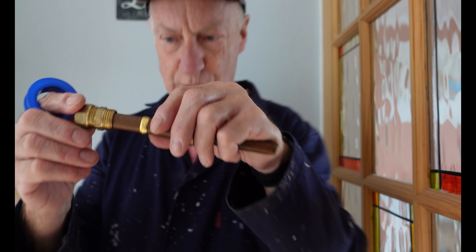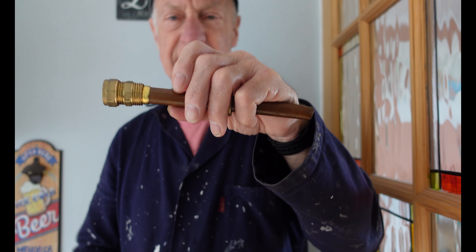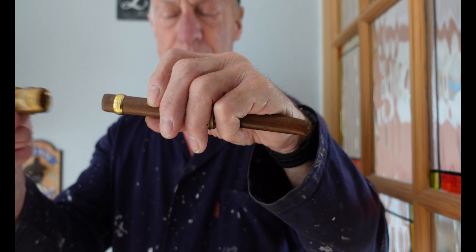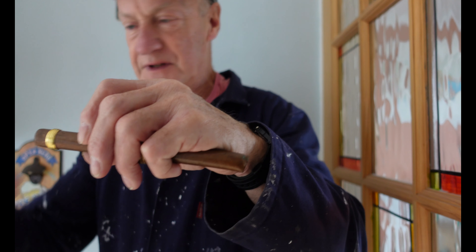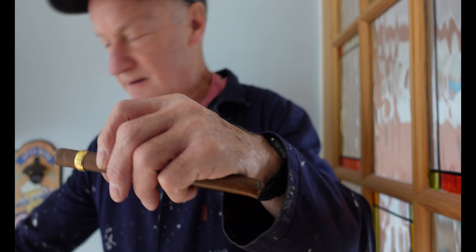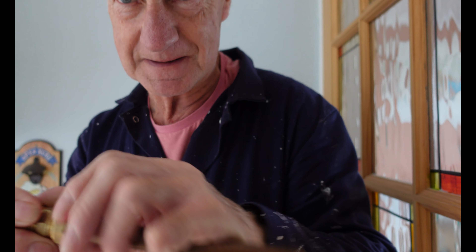Here's our joint sideways on. When you undo it and take the nut right away, you'll be left with the olive just showing there. Obviously if you can take it right off, all the better if the water's off. Then you can wrap PTFE tape around the whole thing — just about six winds — and push it back in and do it up.